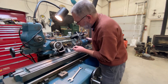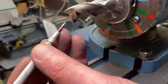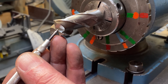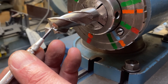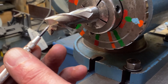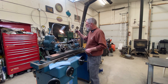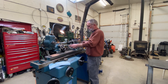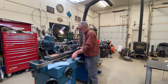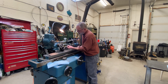That setup is done. We are right through the center here and now I have these little spaces where I can run my wheel off into and not hit the tooth that's supposed to be center cutting — which is this one right here. Now I'm going to take my sensitive work head and move it around and set up for cutting the 3-degree angle this way and the 7.5-degree angle this way.